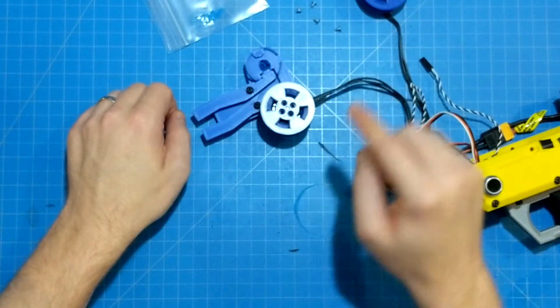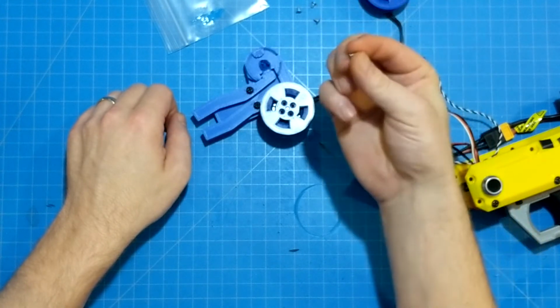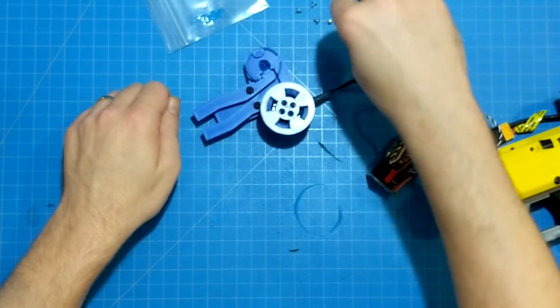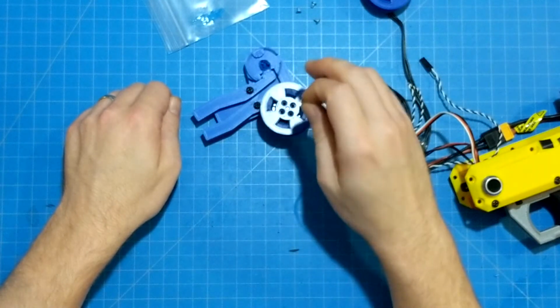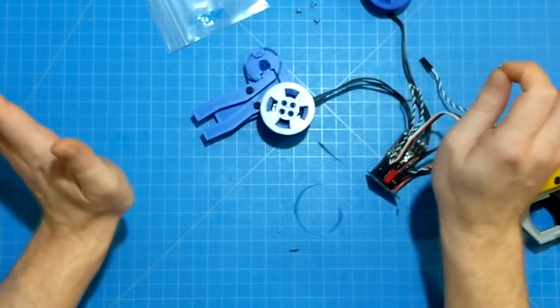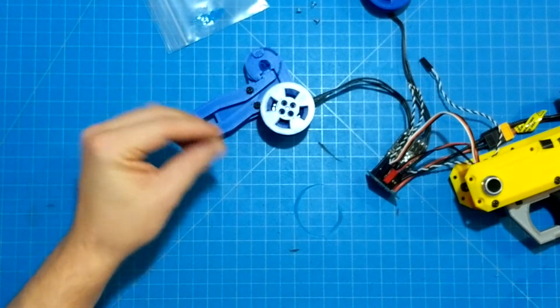These screws that go in here are 2.5 millimeter by 5 millimeter long flathead screws. On some of the older motors, like the original FDL3 motors and the FDL2 motors, these are actually M2 screws. I had these holes made a little bit bigger on here because I wanted a hardier screw. That makes these a little bit of an awkward size to find, but in the bill of materials, you can find them on McMaster and various places.